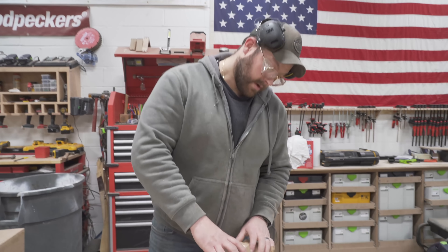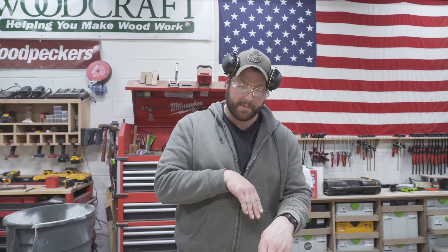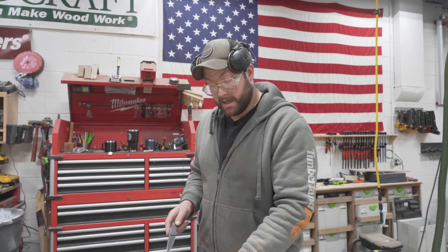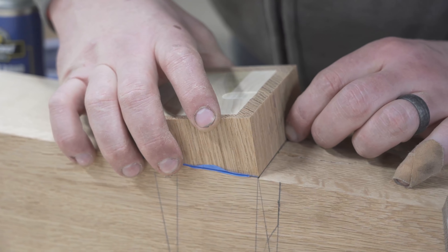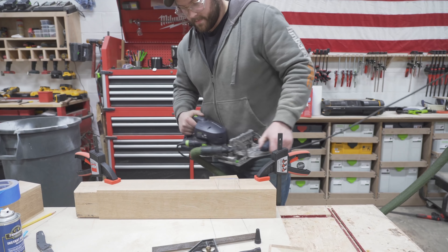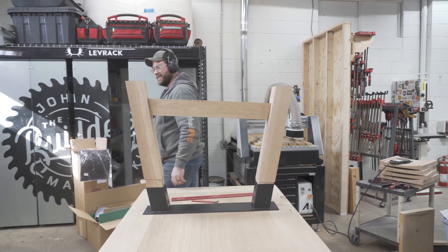I got a little block here. With that angle, this will cut straight in, and that way everything fits straight. If I cut the angles first, the angles would be going opposite of each other. We're going to be using the CA glue tape trick — not invented by, but made famous by Mark Spagnuolo, the Wood Whisperer. Essentially I'm just creating a spacer block and then I'll cut the tenons to the perfect dimension I want. We're going to have to put it in loose.